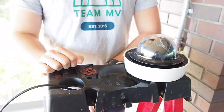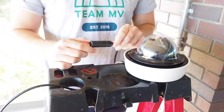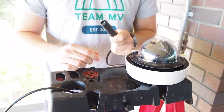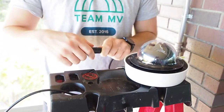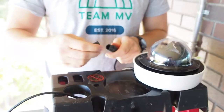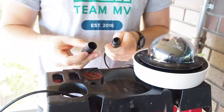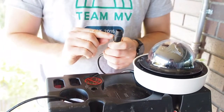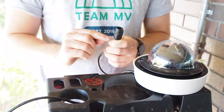The four main pieces come assembled in the box. To separate them, start by tightly gripping the bottom RJ45 pigtail in one hand and the top part in the other. Twist the top counterclockwise to unlock it from the RJ45 pigtail as shown. Make sure that the rubber O-ring that was between the base and the pigtail stays on the pigtail. You can set this part aside for the first few steps of the assembly.